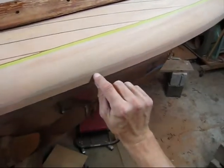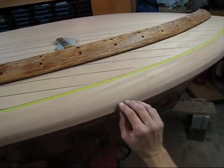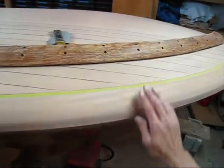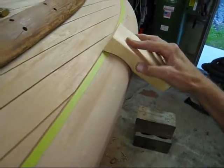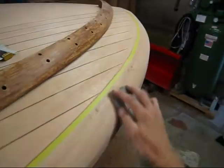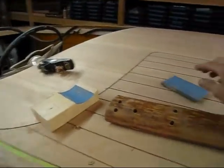I still have some work to do on this covering board where it meets the shear shelf — I've got about an eighth of an inch that I need to leave alone, and that's where the wood rub rail goes on. So I've got some eighth inch pin striping tape I'll probably put on there. I still have a little bit more work to get it down to right where I need it, but it's pretty close. You can see that profile is pretty good. I also use this flexible block here to get the shape down. That's the process I'm using.